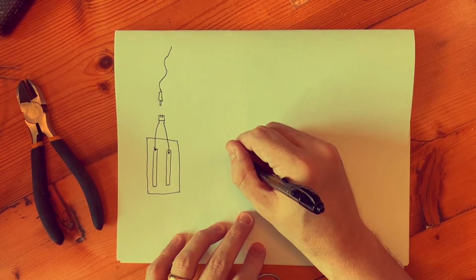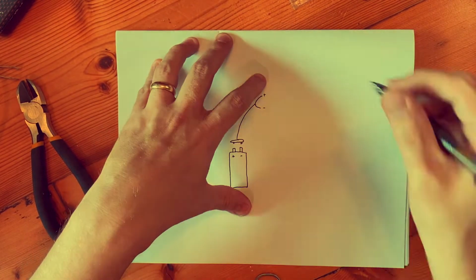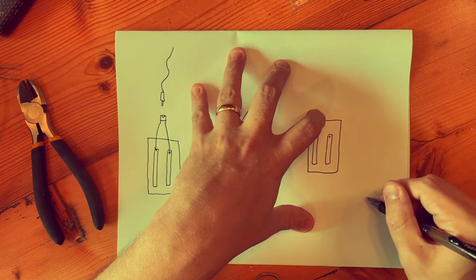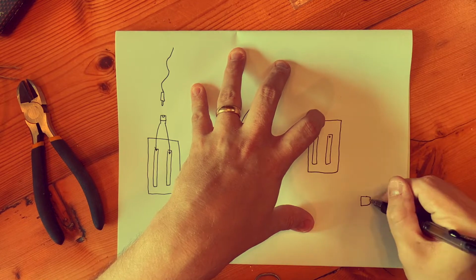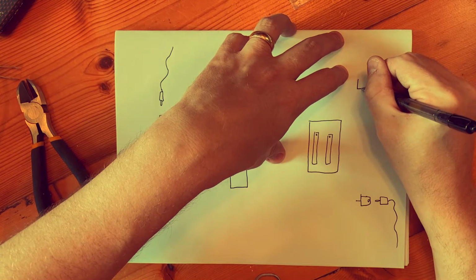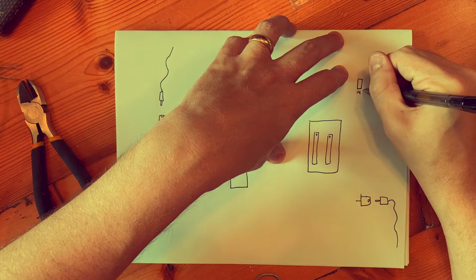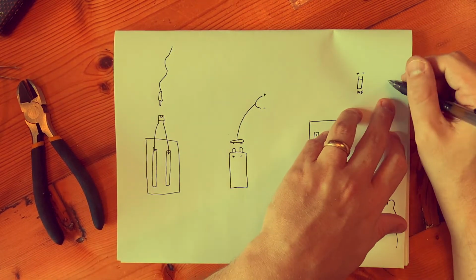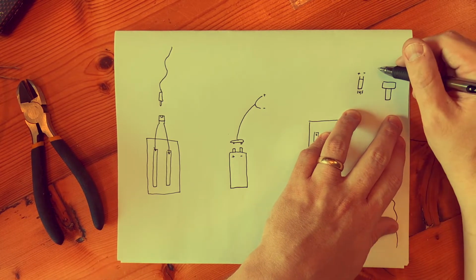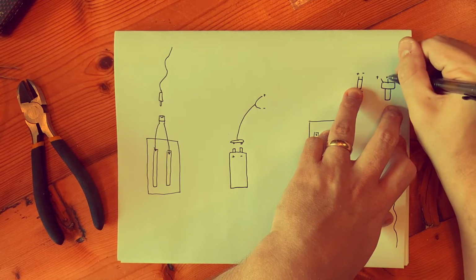And then the second one is going to be the 9-volt battery modulation source. So here we have, this is the jack. Right here, we're going to have a 1 microfarad capacitor. Okay. And then we're also going to have a 100K pot. So the left will be positive. This will be ground. In this diagram, the pot is being shown face down.